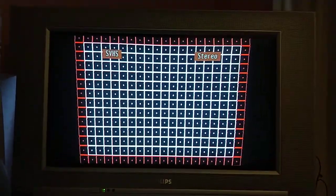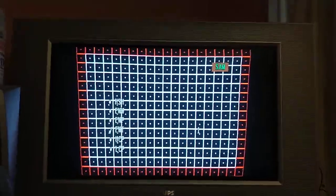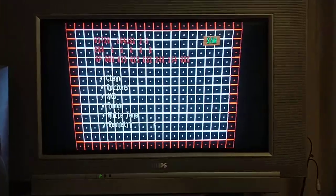Aha. So, what have we got here? 062596. Thankfully, I've committed the service menu code to memory. So, I set it to 5, and it put it at value 1. By experimentation, trial and error, I bet if I set it to 4 and save it, it will save the trapezoid at level 0. So that's the first issue, right?